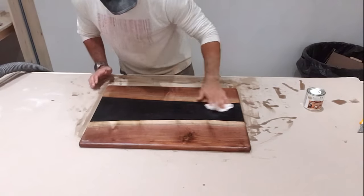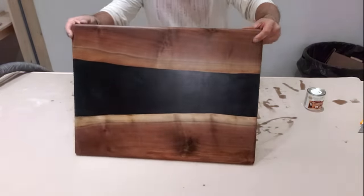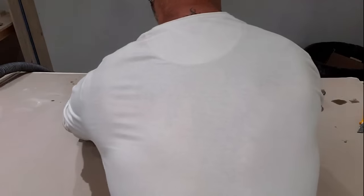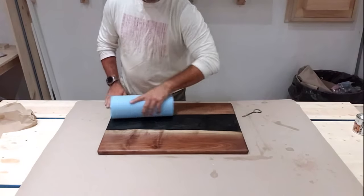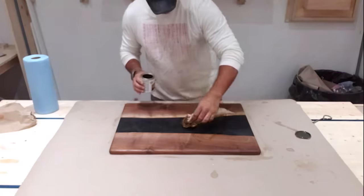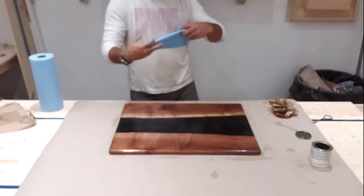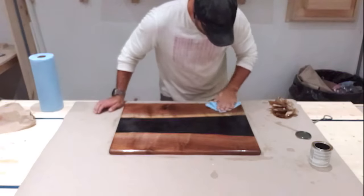After you get that first coat in, leave it for a day and then put in a couple more coats which will give you a really nice beautiful look. I used regular paper towels to work it in. For your next couple of coats, a lot of people use automotive cloths — you get a package for about two dollars. Don't use the heavy-duty ones, which have a pattern embedded; use the regular ones, which are almost like a microfiber cloth. They buff it out nice and clean and one piece will pretty much get it done.